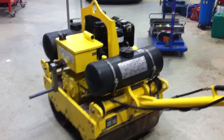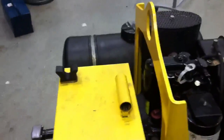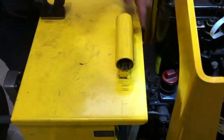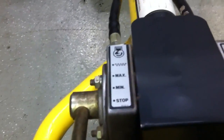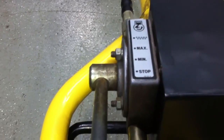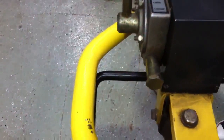The first device is the excess fuel. You can see the excess fuel button here. When you're starting the engine, the control lever is here and there is a position for stop, min, max, and then for starting the engine. To operate the excess fuel, we put the lever into the max fuel position, all the way forward for starting.